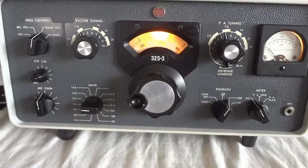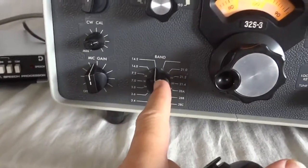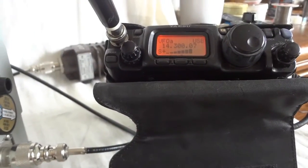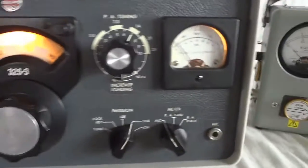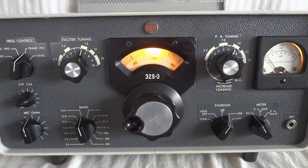Let's go to 14 MHz. We're now at 14.3 MHz — the switch is at 14.2 plus 100 kHz is 14.3 MHz, which is also what we have on the VFO dial. We're on upper sideband. We get 125 watts on 14.3 MHz. As you see, my ALC is barely moving — which is what you want. If it gets too high, back off the microphone gain.